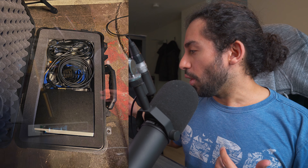The wireless worked really well and I'm happy with my decision to buy it. I'll keep carrying it in my Pelican case until I get a rack to build it into. A lot of people will ask why I didn't buy a small pedal board wireless unit — the reason is those operate at 2.4 GHz or 5 GHz, which at least here in Germany are very prone to dropouts at larger shows, open airs, and festivals because those frequencies are crowded by mobile phones, Wi-Fi, and Bluetooth. With this system you're outside that range and get a more stable signal.